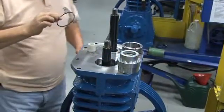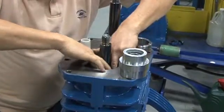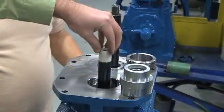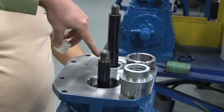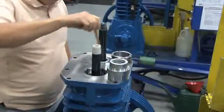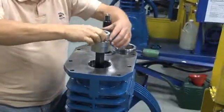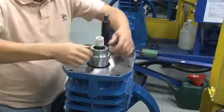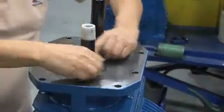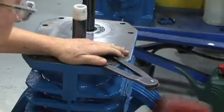To begin the packing box installation, first place a new O-ring from the repair kit gasket set onto the landing in the crosshead guide. The packing box will seal against this O-ring when put in place. Then take your packing box installation tool and place it over the threads on the crosshead piston rod — this will prevent the threads from tearing or scratching the packing during installation. Lightly lubricate the crosshead rod and packing box installation tool, then install the packing box on the crosshead rod and slide it down until it firmly seats on top of the packing box O-ring. Place the packing box hold-down ring over the crosshead piston rod and down over the packing box, then use the spanner wrench to tighten the hold-down ring, tapping gently with the hammer to secure it.